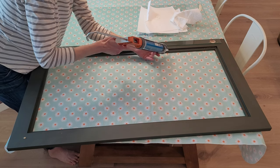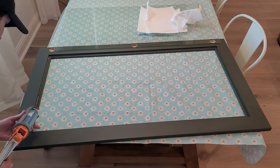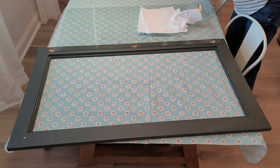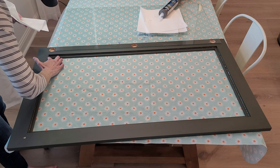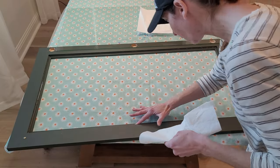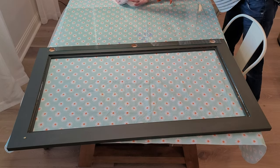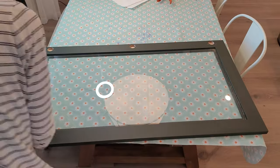I ordered these cabinet doors online — I was able to specify soft close and that I wanted a glass insert in the exact size. It was a really great company to work with. Now I'm adding a bead of silicone to attach the glass. Once the glass is in, I waited 24 hours and added another bead on top, so the glass is secured by silicone caulking. There are other methods too — you can use plastic or wood inserts in the groove. I ordered the glass through Amazon.